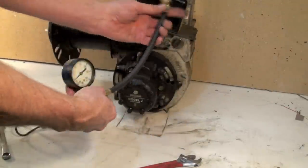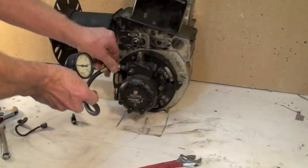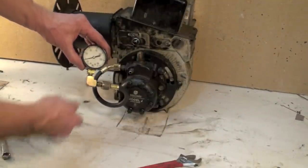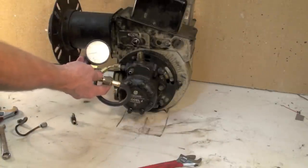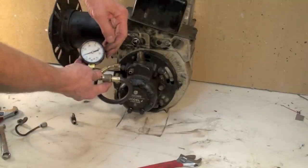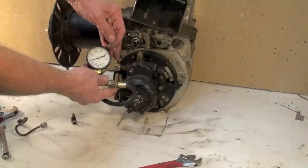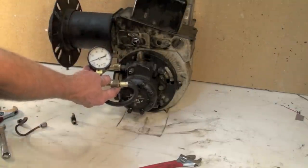Hook this right to here and make sure both of these are tight. You'll start the pump by turning on the thermostat and allowing the burner to come on. It's going to safety out because it's not pumping any oil up there. The pressure should pop right up to whatever the pump's rated pressure is — minimum is going to be 100 pounds. This cad cell relay over here will safety it out after about 40 to 45 seconds.